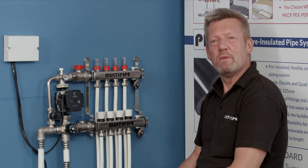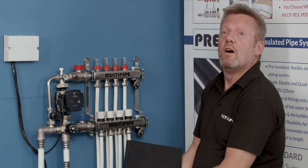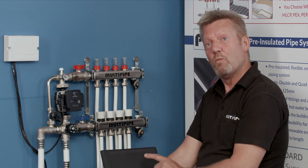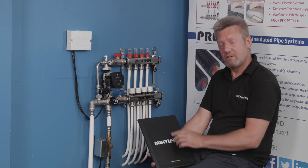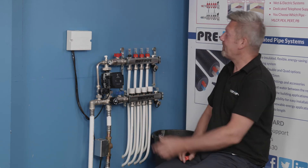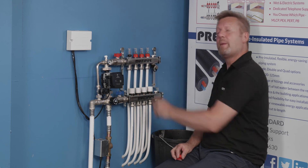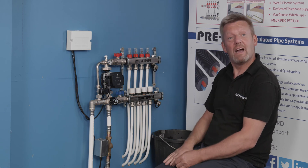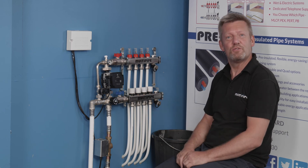After replacing the flow meter, it's important to set the flow rate for the loop length. From 2021, MultiPipe launched the homeowner's pack which has clear and simple instructions for the installer on what flow rate to set. For this particular loop, the homeowner's pack indicates it requires 2.75 litres a minute for the kitchen dining loop. Remove the cap, open the flow meter to achieve that required flow rate of 2.75 litres a minute, and once you're happy, lock the flow meter back in position with the locking cap. Thanks for watching, see you next time.